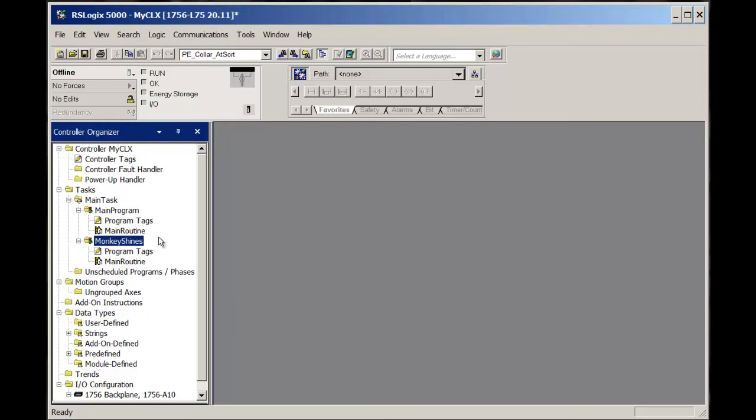However, they don't have separate I/O. So, and you'll see in a minute, when you add I/O card modules on a 1756 backplane or wherever they're at out there, you have to add each one individually and configure it, because with this product, you cannot assume that the processor owns everything out there that is accessible. You have to tell the processor, as part of its hardware image, what belongs to it. So we're going to pause for a second here. We're almost up to 25 minutes. I think we'll come back and add an I/O card or two and then continue on.